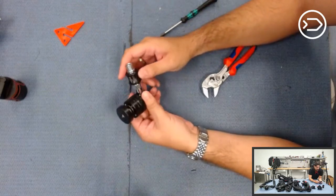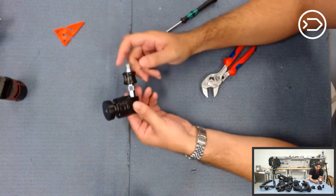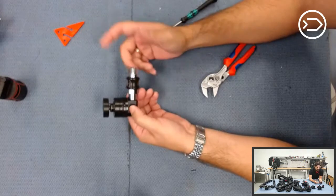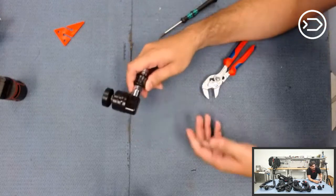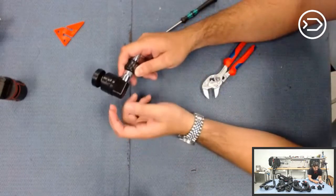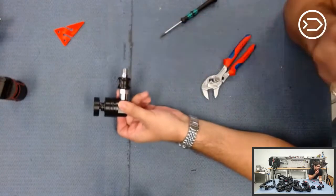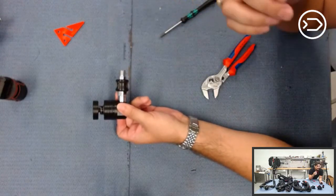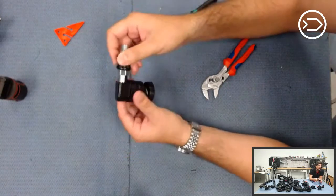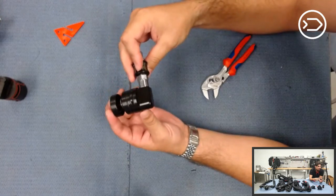If I just wanted to use the inline shutoff, no problem. The front mount counter lungs are very nice because they're very accessible right on your chest — you can reach everything almost as easily as your mouth, just like the back mount counter lung manual add valves located at the mouthpiece of the bailout valve. That's our mechanical ADV for front mount counter lungs.